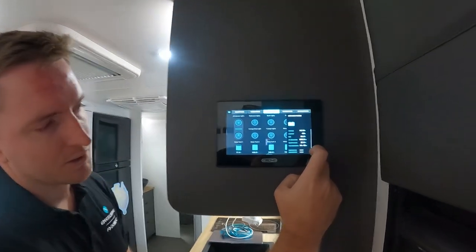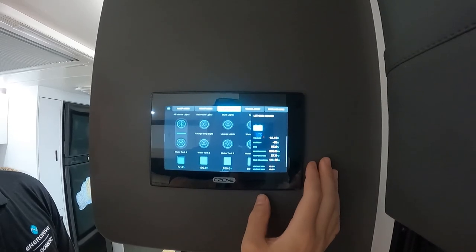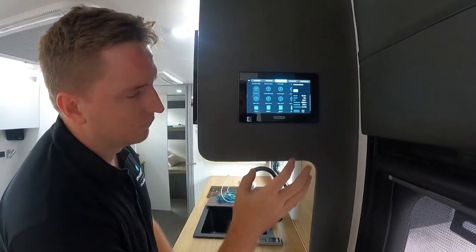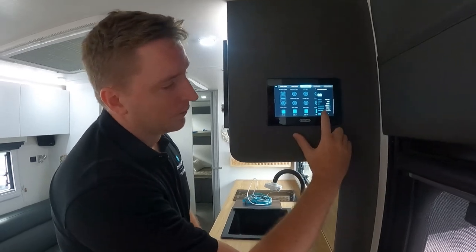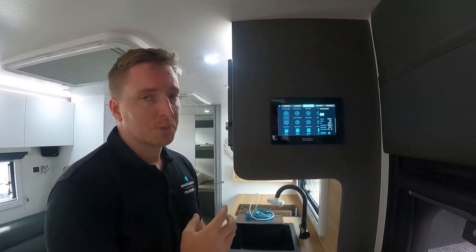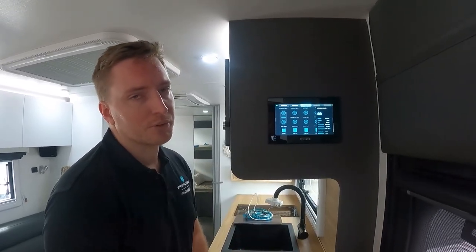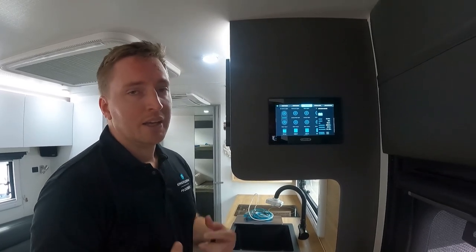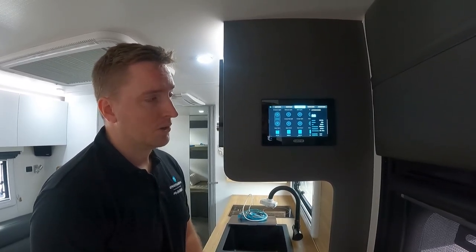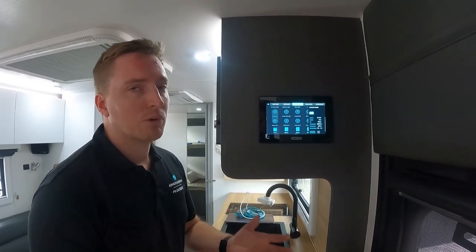You can see at the top here we've got our voltage of the batteries at 13.15 volts, current coming out 58 amps, percentage state of charge 95%, remaining amp hours, temperature — all nice and self-explanatory. Now if you ever lose power in the system or shut it down and restart it, you'll notice that your time to go and your percentage state of charge will both be blank. That's nothing to worry about — it just means the system needs to be recharged to a full charge, then it will automatically sync. Worst case, you can use the Bluetooth app on your phone to figure out your battery state of charge.